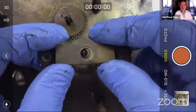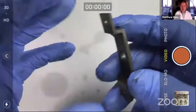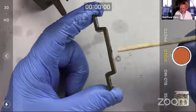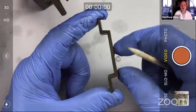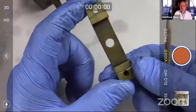But again, please, in the live chat, how would you do it? Ideally, and I don't have that facility at the moment, I'd put a bit of wood in the lathe, just a chunk of boxwood or something, turn it down so it was this profile with a spigot that came out the middle. Then I would be able to feed on the hour pipe and then I would soft solder it in place. Then maybe make a supporting ring.